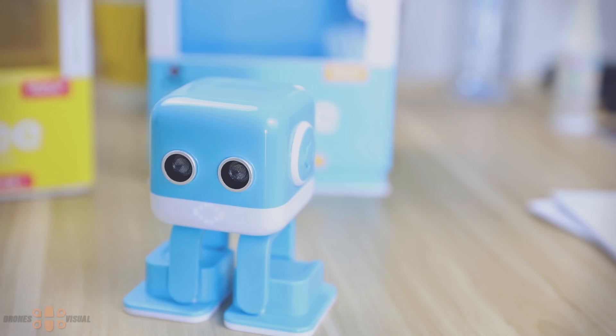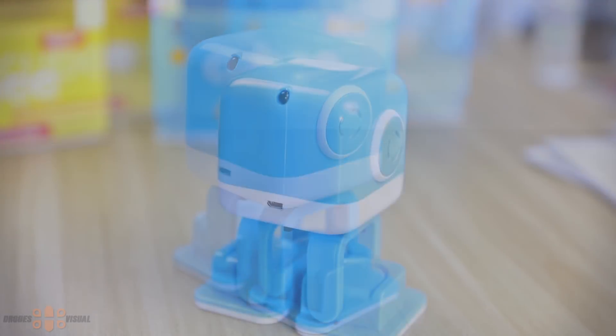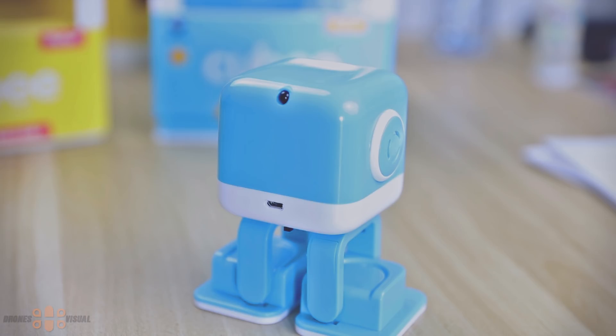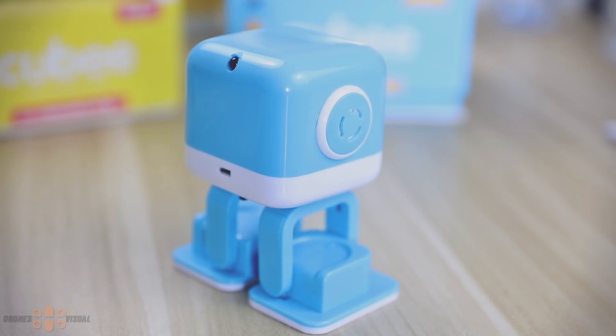The eyes of the Cubies are a very important feature — they are not only here for decoration. Those of you familiar with Arduino and robotics will immediately recognize that the eyes of the Cubies are actually ultrasonic sensors that can detect when something is in front of the robot. On the side of the Cubie we can see the ears of the robot, but these ears rather than listen, they actually emit sounds as their speakers are right under them. On the rear section we will see an infrared sensor and right under there is a USB port to charge the robot. The Cubie comes with an 800 milliamp battery that should give you around 1 hour and 30 minutes of usage time, which is pretty good. On the bottom we have a power switch to turn on or off the robot. The moving parts seem to be composed of four servos — two located externally in the feet and the other two that control the rotation of the legs are located inside the body.